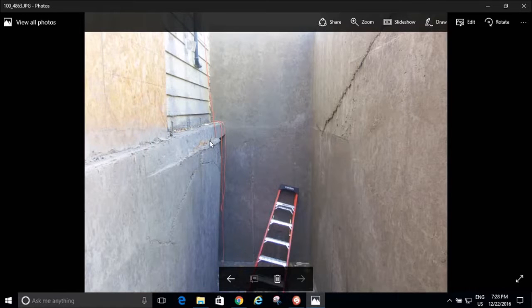Because when you cut into the concrete, it's not like you're slamming into the wall this way. You're just coming down and chipping it off. So I still got all my rebar in there. My concrete cured just fine. I got 4,000 psi concrete in here, so it didn't do anything to the strength of the walls by me cutting them back like I did with a demo hammer.